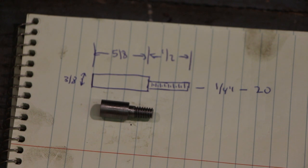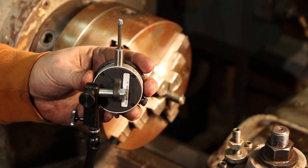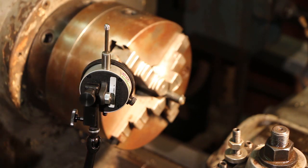There's the finished part - and my pretty bad drawing when you look at it in scale, but it gets the point across. We're going to try this out on my indicator and my Noga base and see how it works. There it is - my little mounting stud mounted on my indicator. That little 3/8 shank will go right up into my Noga holder. I tighten that up and I think we've just made a very vast improvement to this already really nice indicator. Adam, thank you for the tip - I like it. You ought to patent that and sell it to Noga. Who knows, you might get rich at 97 cents a piece or something. Thank you, Adam.